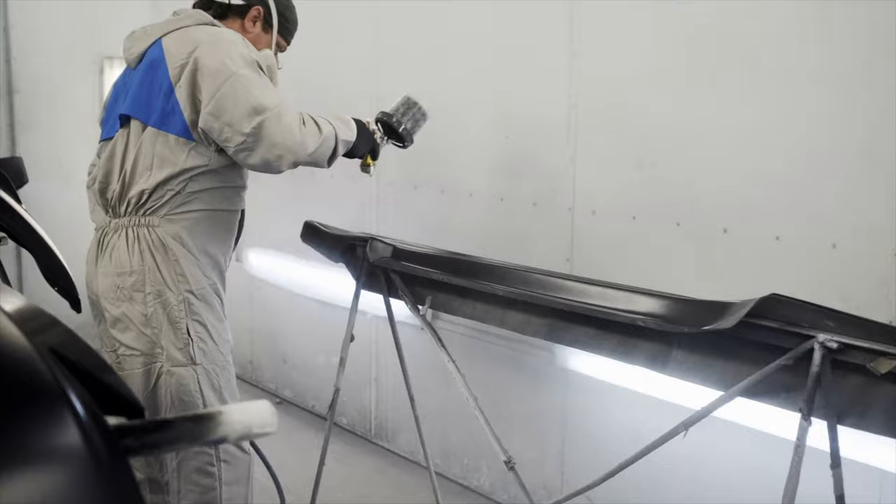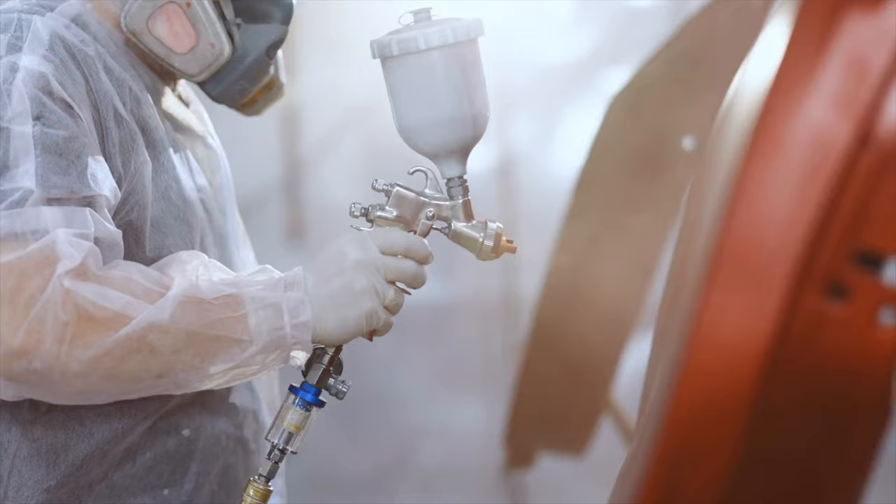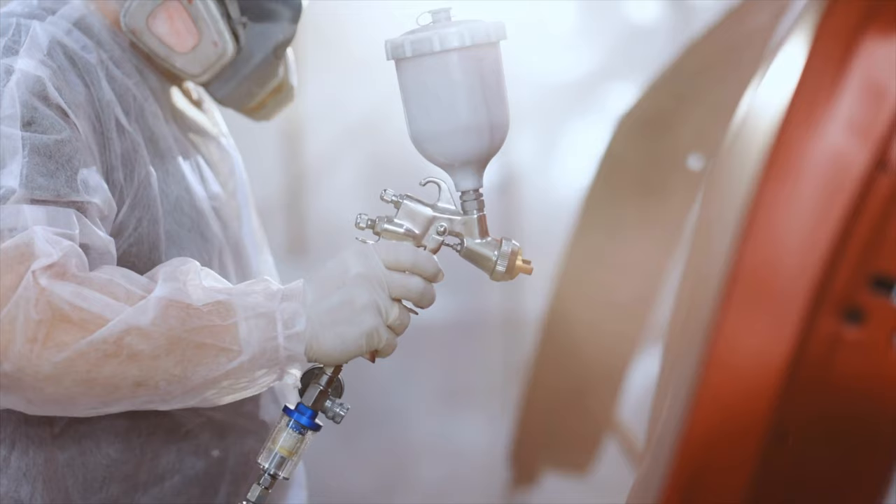Different paint compositions determine how you will need to set up for your paint job. We advise opting for an alkyd paint rather than acrylic paint, as alkyd paint has the best price-quality ratio and is perfectly suited for steel. You can also choose between one-component or two-component paint. One-component paint is ready to use and very user-friendly — it is priced lower, but a primer may be necessary as an undercoat.